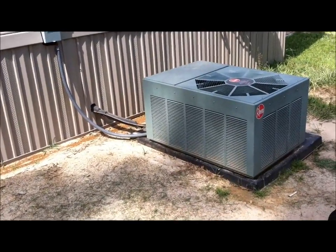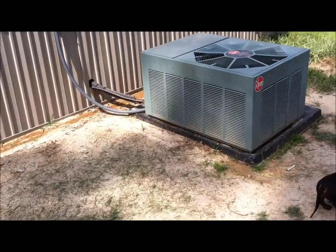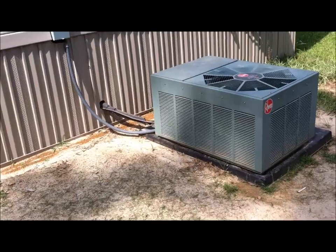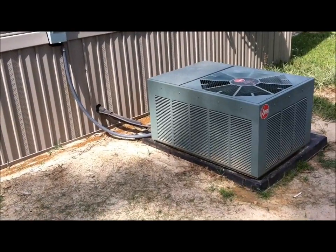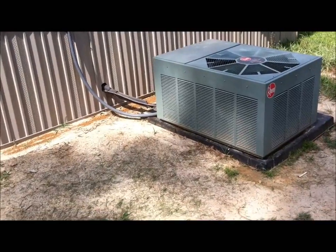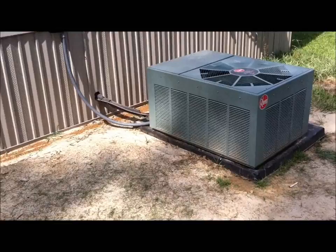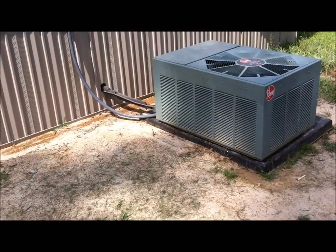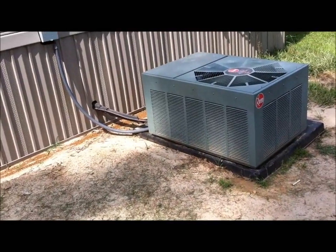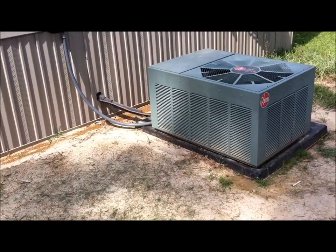So what I decided to do is go with a 3.5 ton system because, as we know, 1400 CFMs is 3.5 tons. If you set the blower on this mobile home air handler on high speed, it will move 1432 CFMs, so that is enough to cover 3.5. Technically, by the size of this house, you don't need but a 3 ton, but it gets hot over here in Louisiana, so I'm going to go with a 3.5. I think I'll be okay.